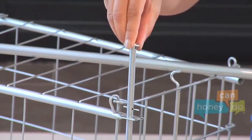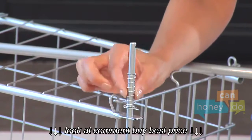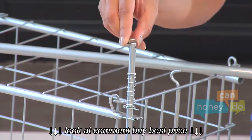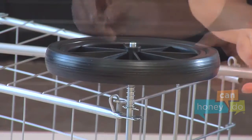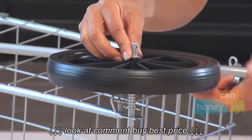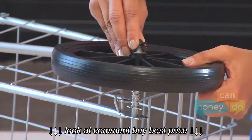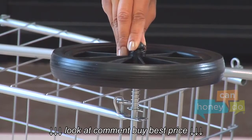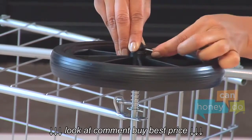Take notice that the cotter clips are outside of the frame tubing. On one side of the axle, slip on a washer, a spring, a second washer, a wheel, and a third washer like this. While holding the wheel in place, put a hubcap on the end of the axle, making sure the hole in the hubcap for the cotter pin lines up with the hole in the axle.